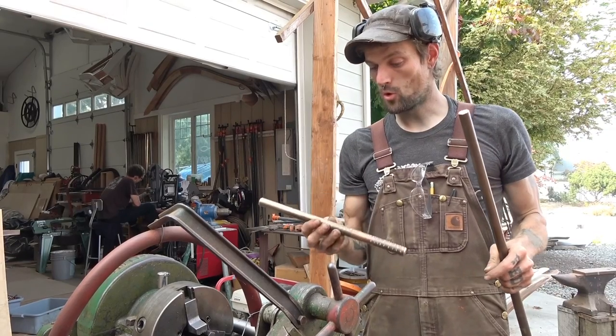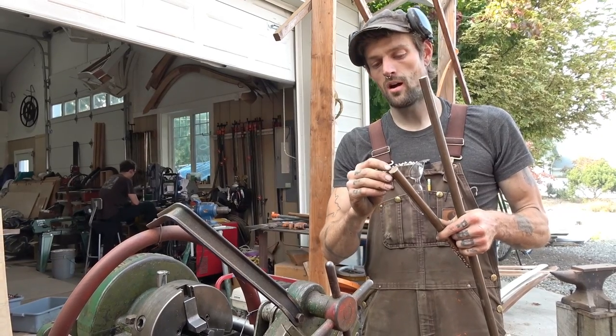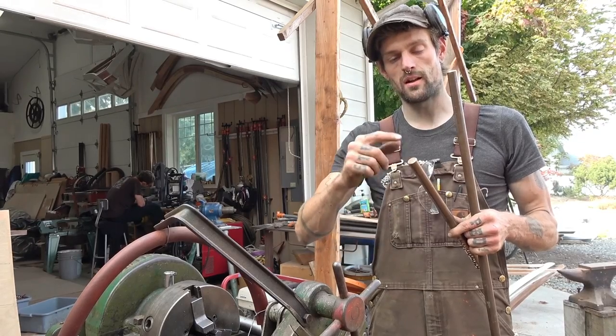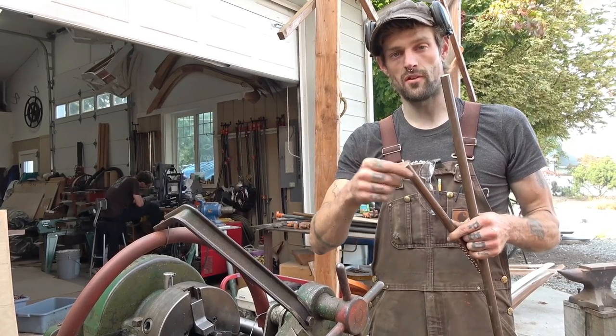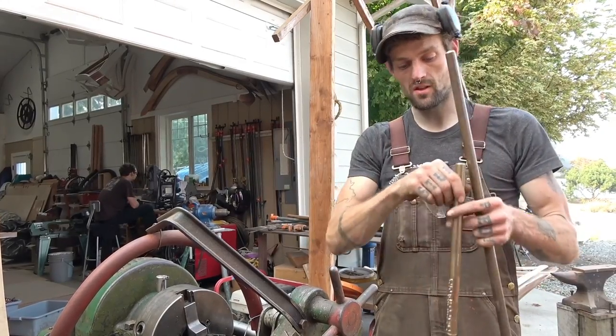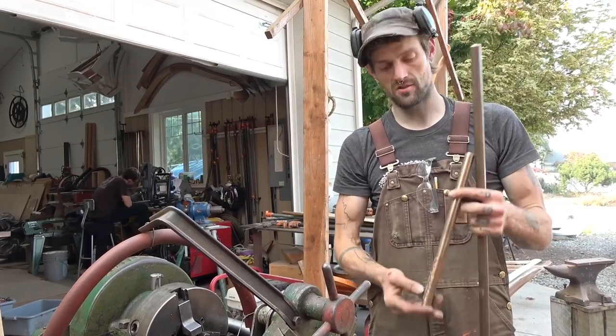So this is gonna be a floor drift. I'm gonna put about an inch of threads on top, and that's just gonna get a nut, and I'll have a little bit sticking out, and I'll peen that over to disrupt the threads so that nut can't come loose. It's gonna get driven down like this, and it bottoms out into the wood. It doesn't come through the other side.